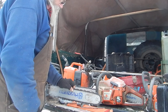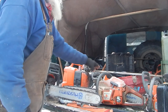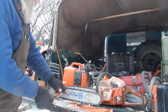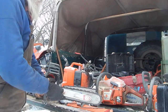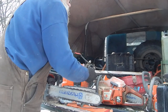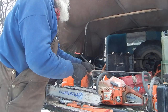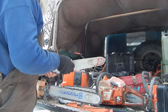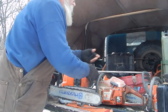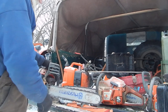You've got to use the right oil for the right season — it's very important. Keep that bar tight. Like I said, this bar has been on here a long time. It's an Oregon bar; the Husqvarna bars are made by Oregon — they're the exact same bar. I keep the 24 inch just for ripping. As a bar wears down more, I use them for regular cutting, but a new bar is always used for ripping first.